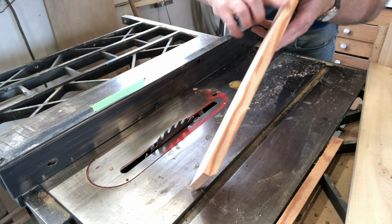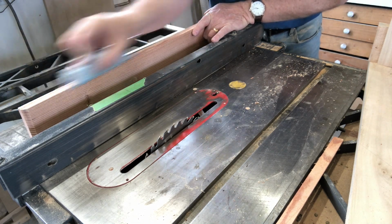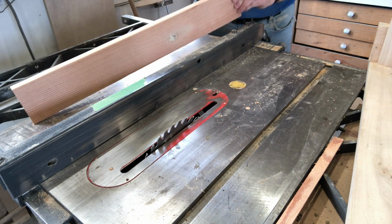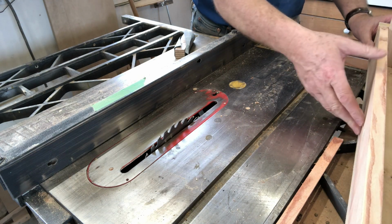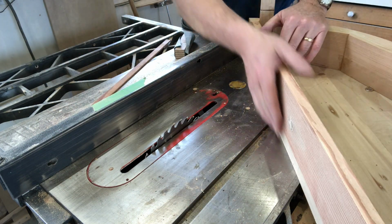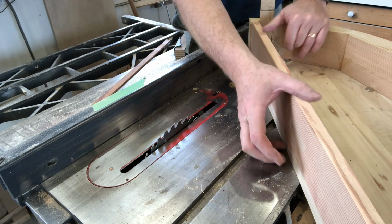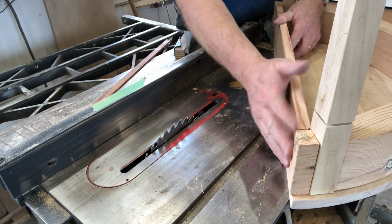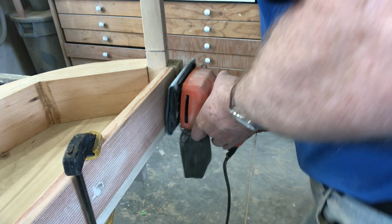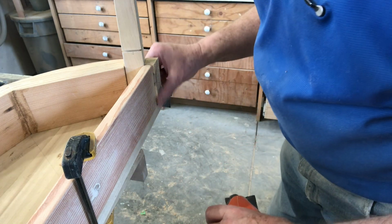Okay, give that a light sand and take off the sharp edge. Much better for handling. Okay, that fits in very nicely onto the table. I get flush right across the whole back, which means I can put that in place and then sand off these little protruding ends. So once this is screwed onto the leg and I have it fastened down to the top, I'm going to sand that off. Little splinter broke up, but I'll glue that in, maybe, or just use filler. And I'll carry on with the sanding and come back when I'm done.